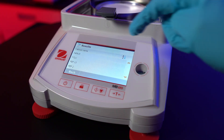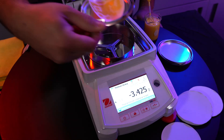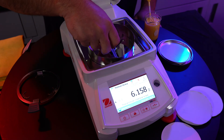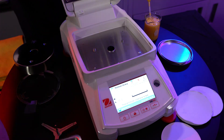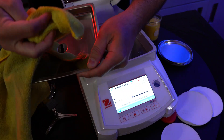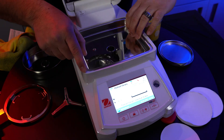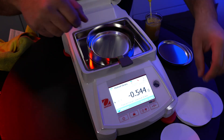If you need to check previous testing results, tap on the notepad and pen icon. To achieve optimal testing results, I highly encourage cleaning out the instrument of any spilled debris after every test, especially when testing dry food samples where debris can easily get into the crevices of the device. Remove and dispose of the sample, remove the pan holder, remove the air shield — you can also remove the chamber from the body. With a clean wipe or brush, clean out the remaining debris. Now reassemble all the pieces back together, apply a new sample dish and glass fiber pad, and you're ready to start the next test.